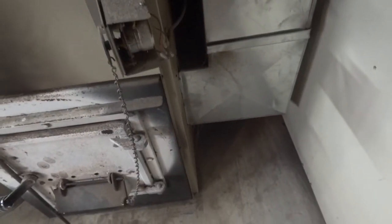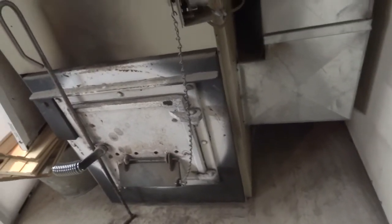Then you usually use something with a swoop in it. It directs the air not to hit flat. It goes round, it almost spins like a round duct, but it at least directs it down. Now that supply air plenum was cut, and now it's feeding the Scotty SS add-on wood furnace through the return air slot, or where they cut it anyways.